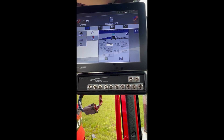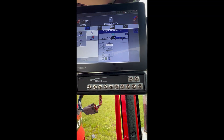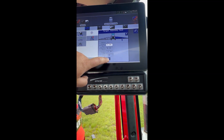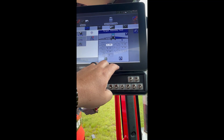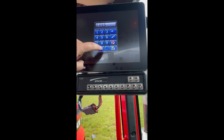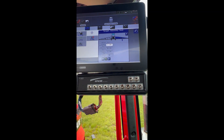Now we want to do the same for the right side. We are at our 2 degrees and we want to be at a negative two degree angle. So here at our negative two degree angle, we press play. It's currently raising. So we're at about a 1.4, so we need to adjust that. Go to gears. Our target velocity — let's lower that down to speed it up. Let's go back down to our negative two degree angle and press play.